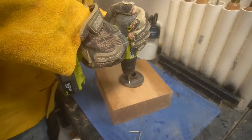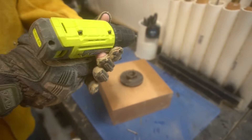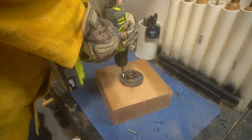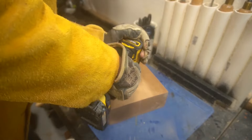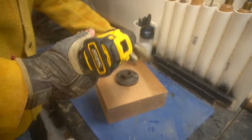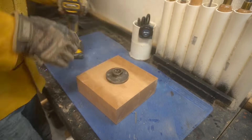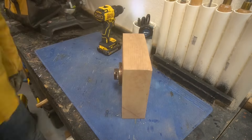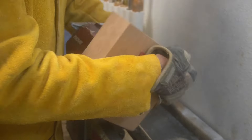This is a very large piece of lumber and honestly it's a little too big for my lathe, but we're gonna work the problem and get it made. Right off the bat we're already having problems — putting the faceplate on was a hassle. Cherry isn't a very hard wood, but I had to use both my Ryobi and my DeWalt drill and ended up stripping the bit trying to get the screws in.